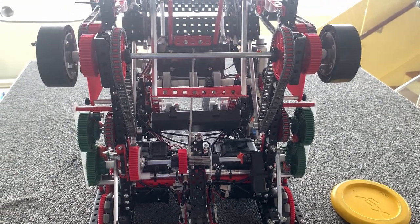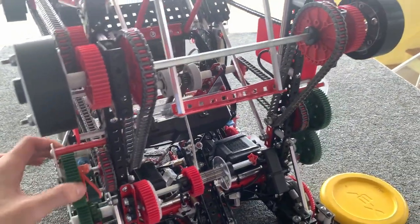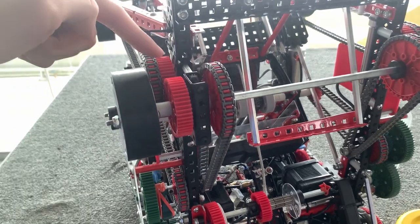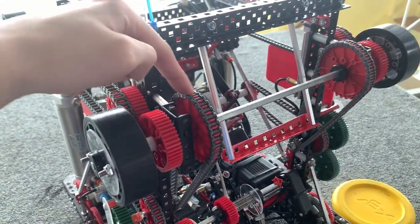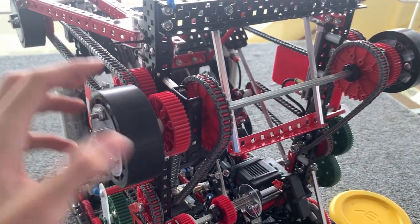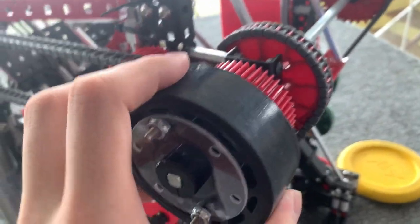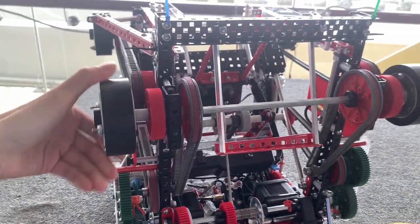Next I'll talk about the intake and roller combo. If the ratchet spins the other way, it's going to be driving the intake and the roller. This is kind of just a complex chain system. On this ratchet shaft there are two chains. For the roller, it goes from 360 RPM to 104 to 90 RPM on my roller. I run double rollers over here to make sure I can get a roller as easily as possible. The chain over here drives this gear, making sure that the rollers are spinning in the correct direction — so in autonomous, I only have to spin a quarter turn. Then the gear goes here, and the chain goes to the front. This is screw jointed, and now everything is driven. I chose to use polycarbonate gussets here because I don't have any VersaHubs left. But overall they work pretty well.